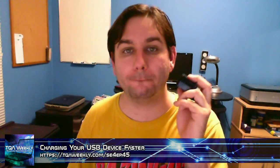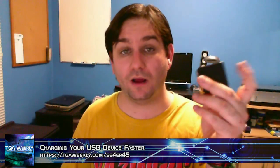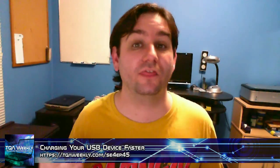Now, knowing that we're not going to get more than 100 milliamperes, that is 0.1 amps, we can easily figure out by reading these wall warts that they have more power. An Apple charger that plugs into the wall for the iPhone 5 has 0.15 amperes, the same as USB 3, 150 milliamperes. My charger for my tablets has 300 milliamperes, so 0.3. You would expect to charge 3 times faster than the computer, and that is a fairly fair assumption. So basically, we can already guess that it would take less time.